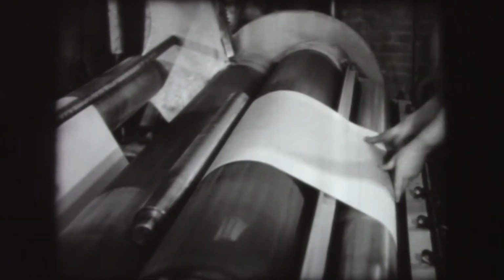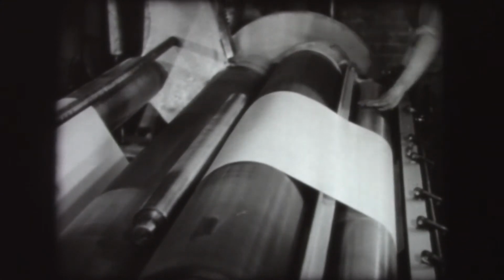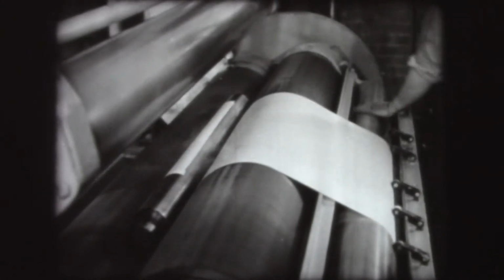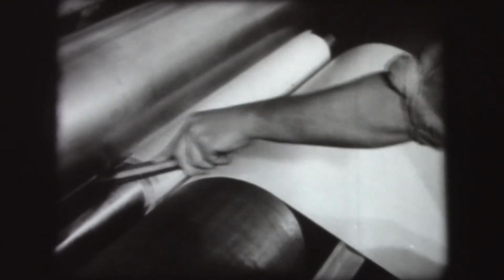From the impregnated rolls, tubes can also be made by sending them through a tube winding machine. Fine weave fabric that has been impregnated with resin is used for this. The rollers exert heat and pressure, and the impregnated material is wound onto a steel mandrel of the required diameter for producing the inside diameter of the tube. The wall thickness of the tube is checked often to make certain it will be the required dimension.